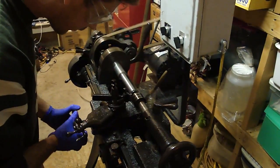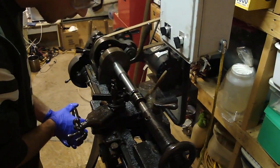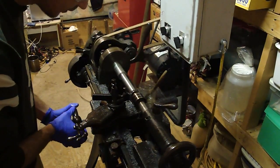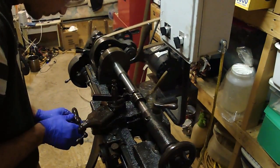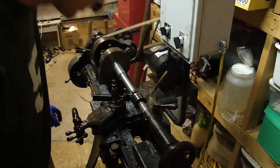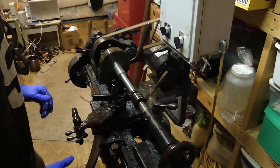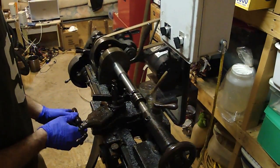90, 95, 100 - coming around to 72. This little shoulder keeps getting smaller and smaller because of the angle on that right-hand turning bit. I didn't account for that before I started turning it down. So I may have to dive in and make it out a little bit. I'll stop before I get to 72 - I'll stop at 65 and flatten it out.